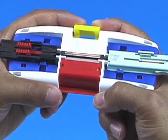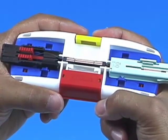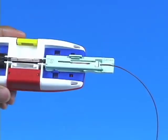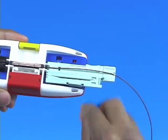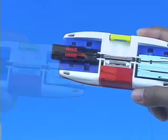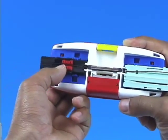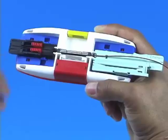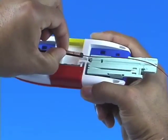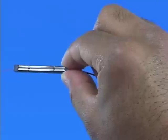Press the yellow lever to disengage the wedge from the Splice Connect Mechanical Splice. Open the 900 micron fiber holder clamp to release the 900 micron fiber. Slide the 250 micron fiber holder clamp to release the 250 micron fiber. Remove the Splice Connect Mechanical Splice from the Splice Connect Mechanical Splicing Tool. Splicing is now complete.